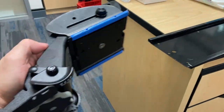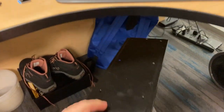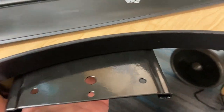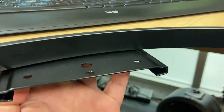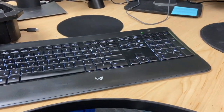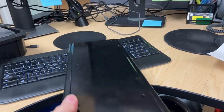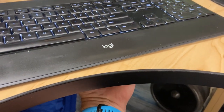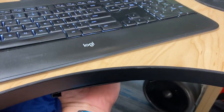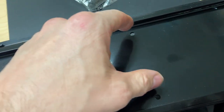This component from the keyboard tray can be removed and weighs around 10 pounds, so take out just this one. This is the easiest part. Figure out where it needs to go — turn it flat side against the table so that the channel in it, you can see the channel component, is pointing down. Pick a direction under the table; you can see between the two monitors where it makes sense to install it. Typically this would be aiming for the corner with the center line of this item. You might want to grab some quick clamps or woodworking clamps so you're not fighting gravity when you put the screws in. After pre-drilling, the screws very simply need to go in there.